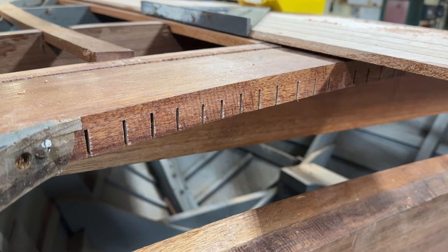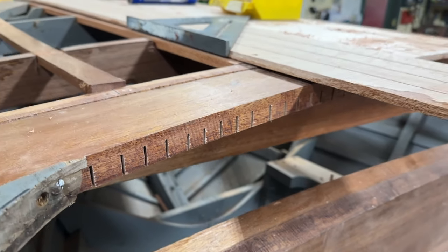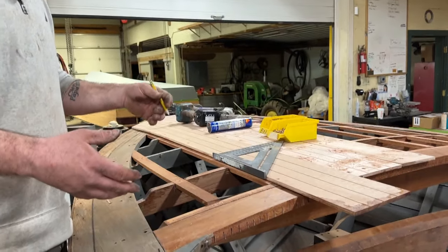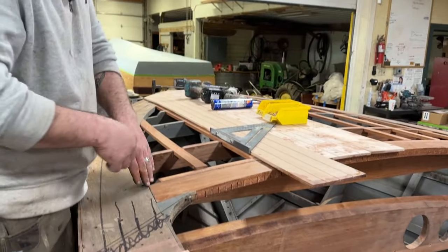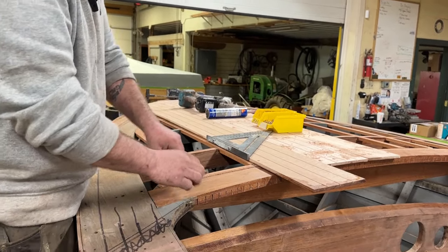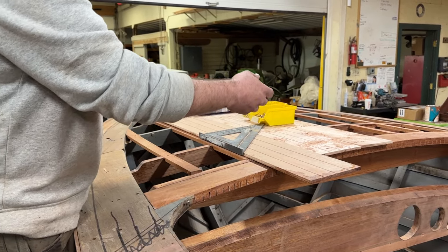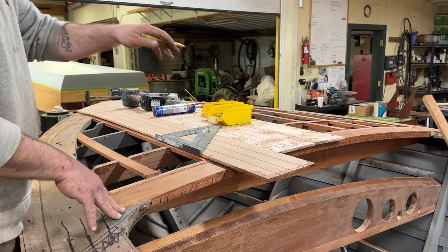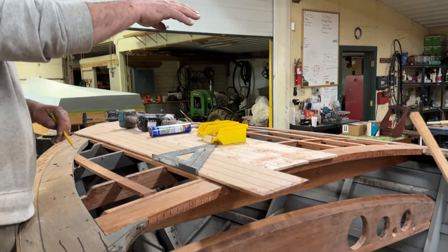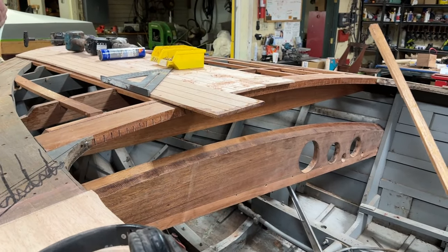The saw kerfs look like they're about on one-inch centers — not precisely exact, but all the depths are the same. Joe put it in, and it makes it so much easier; even one person could do it. It's light enough where you can hold it, and once you have the seam lined up and flush, I took a clamp onto the frame so it squeezed really tight. I went up a little further, raised or lowered it where needed, put another clamp, and by the time I got to the top of the crown, the other side was already completely lined up because the relief allowed it to go exactly where it needed to go. It worked out really well.